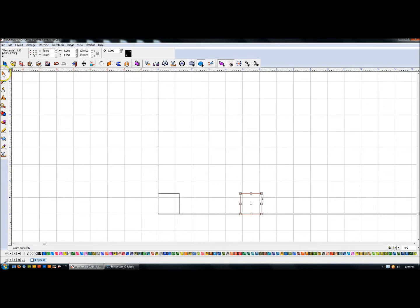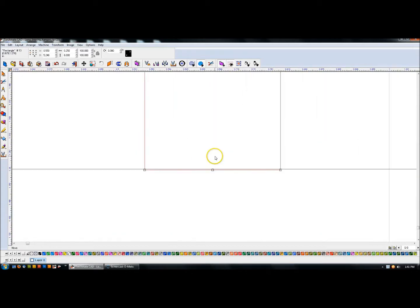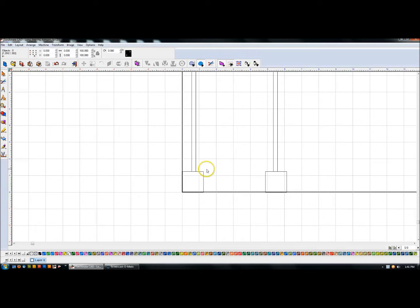I have the bearing hangers — I cut out a quarter-inch plate. I don't care about the height as much as the width: 0.25. From the side view from the back, this is essentially the profile you're getting on the bearing hangers. I'll zoom in, duplicate that, put one over here, Shift-click, Alt+K to line them up horizontally. This little lip right here should be 3/8 of an inch, so the right-hand side should be 1.25 minus 3/8.